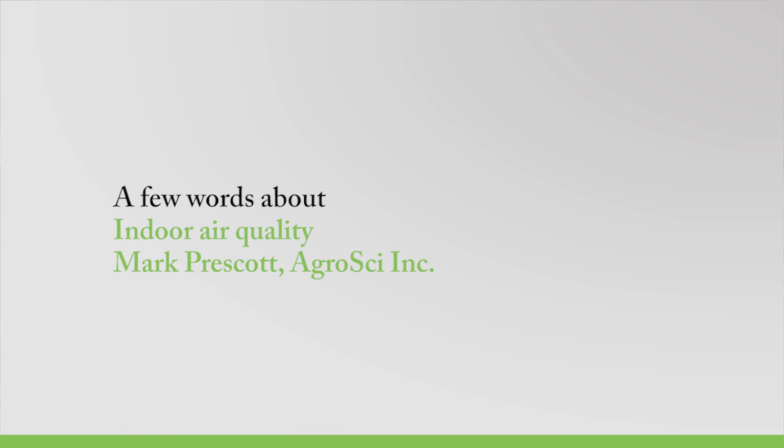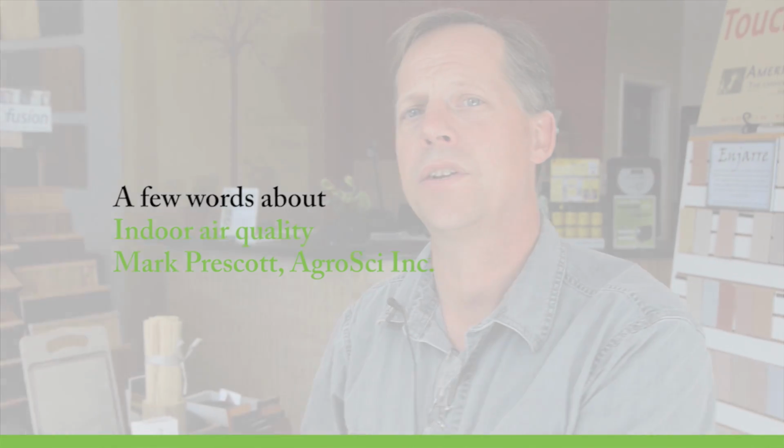Some about indoor air quality in commercial buildings versus a regular residential home. In a commercial building, air standards are regulated by an organization called ASHRAE, where per person, per occupant in that building, a certain amount of fresh air has to be brought in every minute of the day, based on the occupancy. In a home, we don't have those kind of standards.